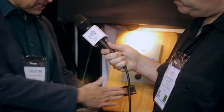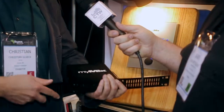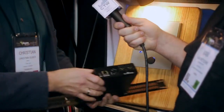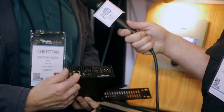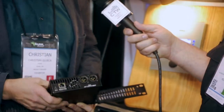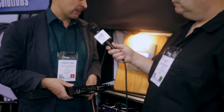The second product is the RX2. I have a prototype here — it's a MyMix rack mixer. There is a 19-inch panel that can hold up to three of them, so you get three rack mixers in one unit if you want, or just one depending on what you need. The rear side has balanced XLR outputs, a network connection, and if you use PoE you don't need a separate power supply.